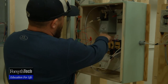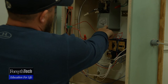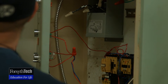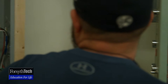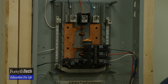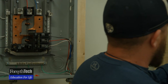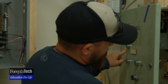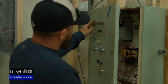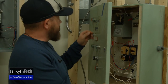Coming to that, you have a 24-volt buck boost transformer stepped down from 240 volts, going back to the three-phase panel with about 208 volts between each phase, and a 15 amp breaker connected to that transformer. Now I'll demonstrate how that works. Hit the forward button — it starts. You can't start the reverse while the forward's going, so you need to stop it. Then you can hit the reverse and it works like that.